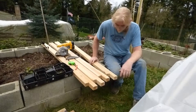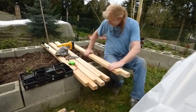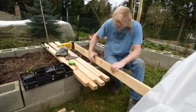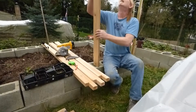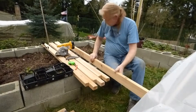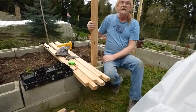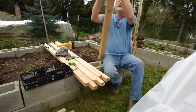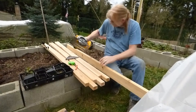That'll give her a little bit more room and take care of not having to notch more, which we can't do anyway. So right now we're going to put some side supports in and I'm going to notch those out. I'm deciding how deep to make them — I don't want to go too deep. Whether the boards are this way or this way — if they're this way, I've got to notch them out on the skinny end and I don't have as much room. That'll weaken the board. But if I notch them on this side, I've got tons of room to work with, and I can go an inch and a half, which is what I really want.